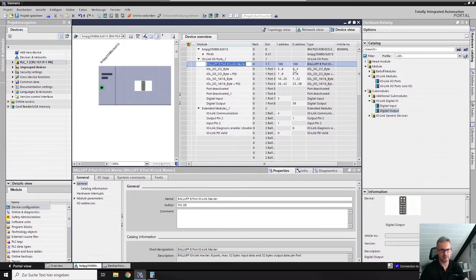Therefore, we need this module here, because this one is the priority. If you want to switch output 1.0 to high, it will be blocked by that address. So if you want to work specification-conform with 2.4, you have to use the area in the upper section. If you want to use your well-known Balluff comfort functions, then you have to replace this area so that these modules work.